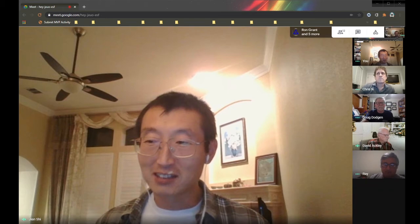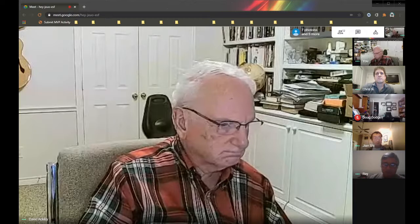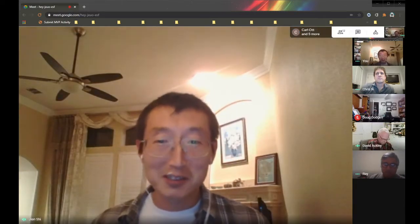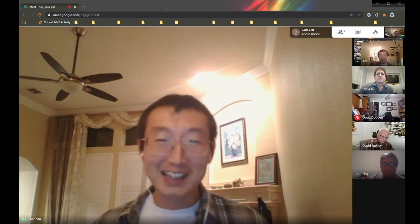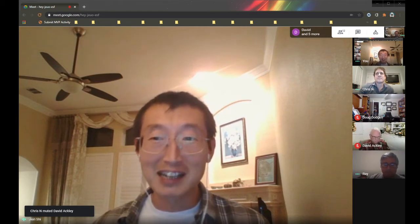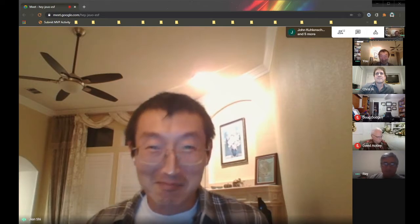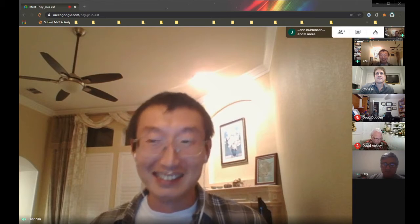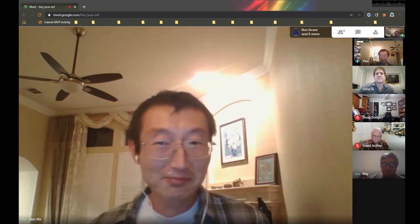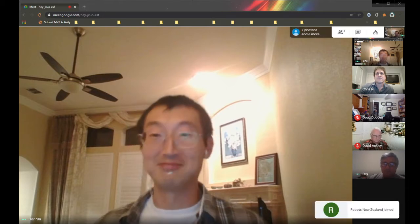It comes down to like 100K, maybe 10K. But anyway, it's just not enough. So I Googled and someone said I can set the baud rate higher, and I did. I didn't go to extreme, but I ended up putting it at 1 million, about 10 times. It just worked. I don't know how fast I can put it in. It was fast enough. If you're talking over your USB port to serial, which a lot of us are, I think you can run that up to like 2.5 million or so, and not even have a problem.